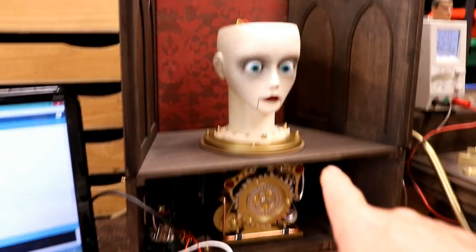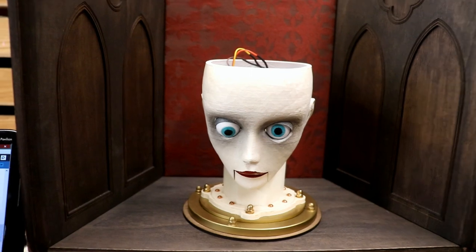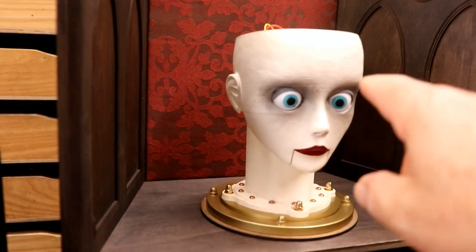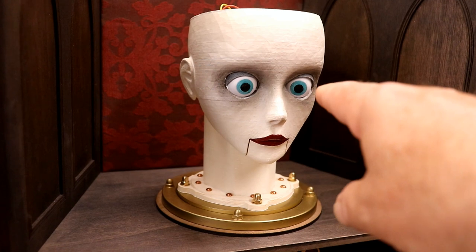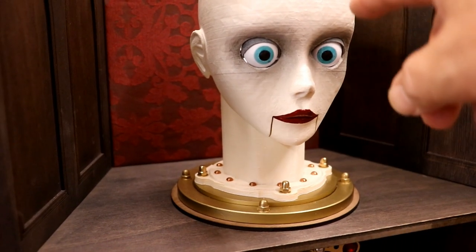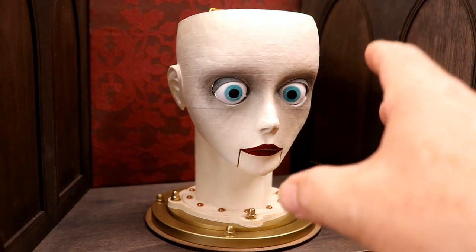Now, however, an issue has arisen that I mentioned previously. When I first switch all this on, all of the servo motors zoom just to some arbitrary position before everything's had time to start up. So her eyelids, that mustn't go above or below a certain value on the servo motor, they cram themselves into her head. Sorry, I'm getting very emotive there. And they move into her head and risk damaging the mechanism every time she's switched on.